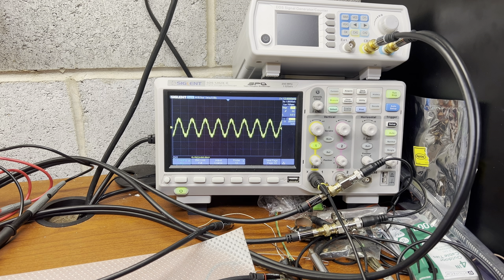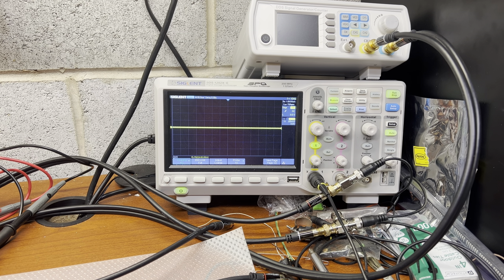I should go to L152 and the coil. Here is the resistor, R264. This should be in the opposite direction. I need a little more time to understand what's wrong, but I'm almost sure that the jump in amplitude at high frequencies leads to overbiasing, and that's why we don't record properly.